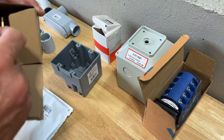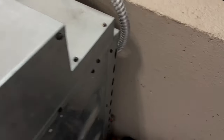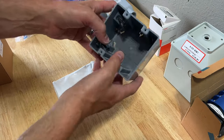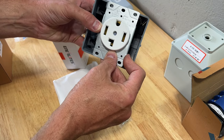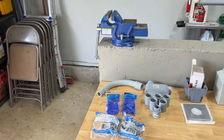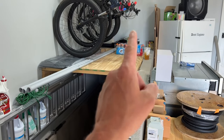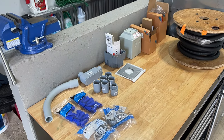The switch mounts inside a box so I'll have a nice switch to flip on the ceiling. I also bought a regular outlet plug that I can use when plugging into the back of my oven. Then there's the wall outlet box with a new 220 outlet and cover that'll go on the garage wall. Those are all the parts I'm going to be using. I'll turn off the breaker first so I can go down and splice into that wire.